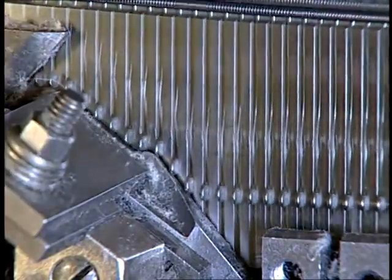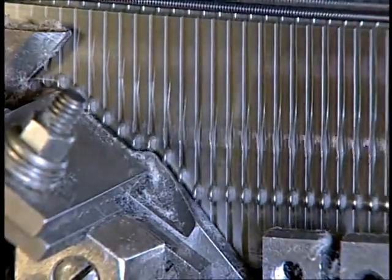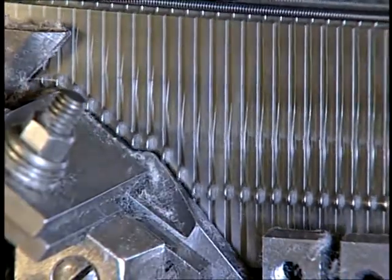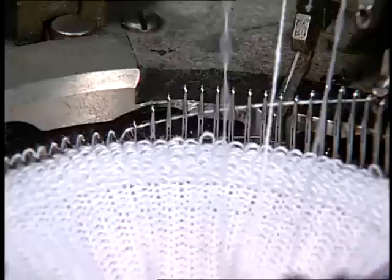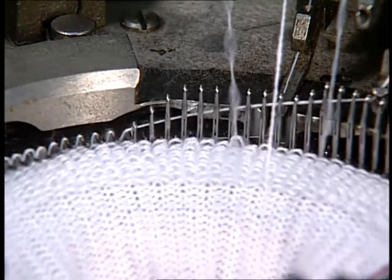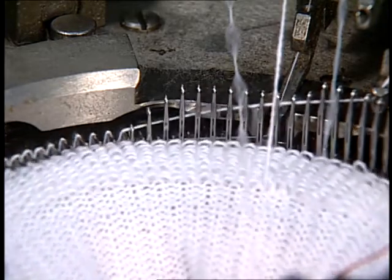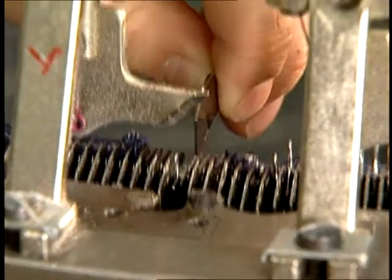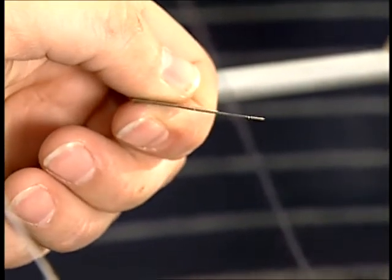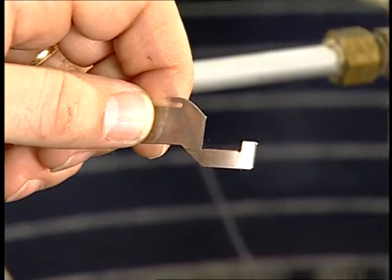Take a look at this same action while the machine works. Watch how needles run through the cam ways, causing the needles to rise and fall. Remember that this machine has a cylinder that contains vertical grooves and slots to hold the needles as needle activation occurs. How does the machine control the movement of the sock fabric as it knits? What prevents the fabric from riding up and down on the needle? There's one more part placed between each pair of needles that better explains this.